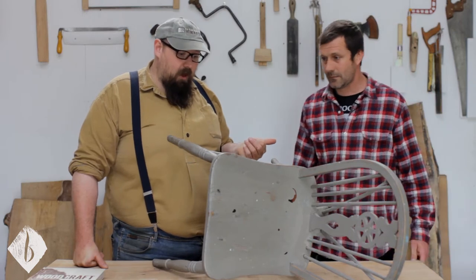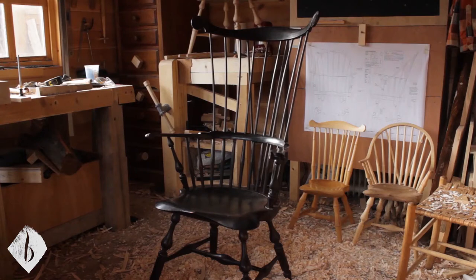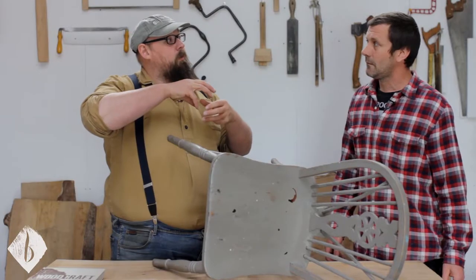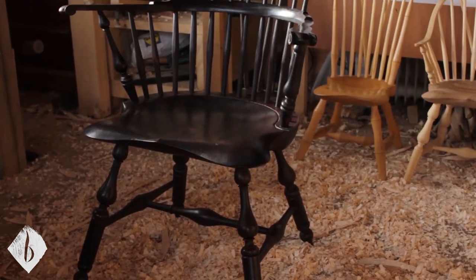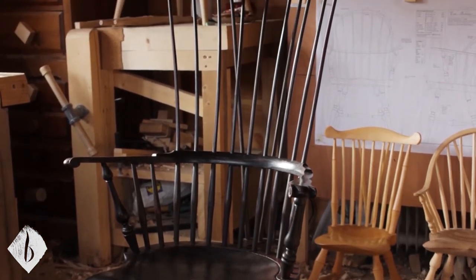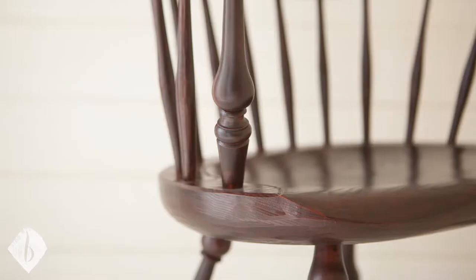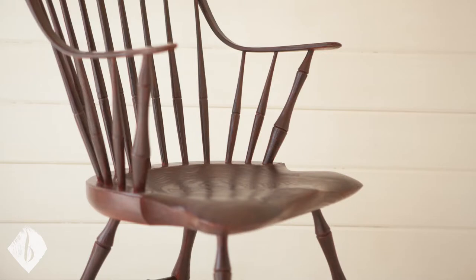Robin makes American-style Windsor chairs — we'll cut to an image of one now. The classic thing with the American ones is they're quite a lot more voluptuous: more diameter to the legs, more scope for movement. They tend to be made from hard maple to get those crisp edges. The seats tend to be a bit thicker and come to sharper edges where they're carved.